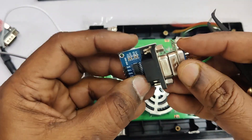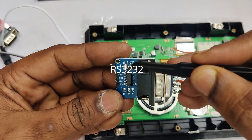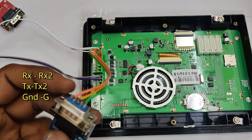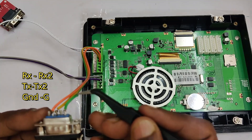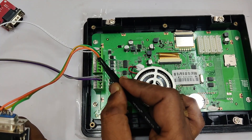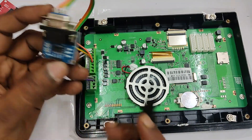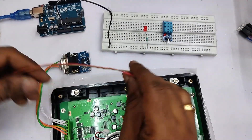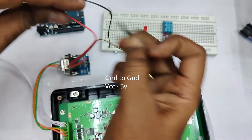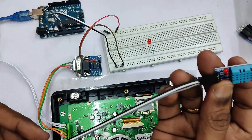For the matching female D connector, a TTL PCB needs to be purchased separately. This PCB has a 3232 IC which is capable of 3.3 volt as well as 5 volt logic levels. Let us connect this RS232-to-TTL to the DWIN display. The connection is straight — RX to RX, TX to TX, and ground to ground. Note it is not reversed; it is a straight connection. The other end is connected to the Arduino, and the RS232-to-TTL requires a power supply — connect VCC to 5 volt of Arduino and ground to ground.